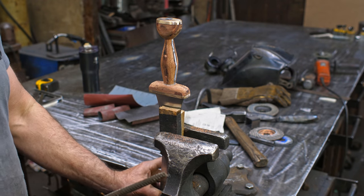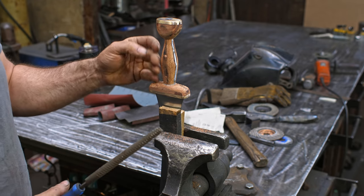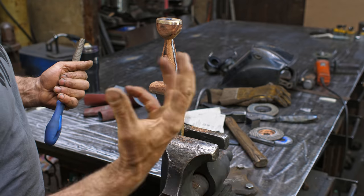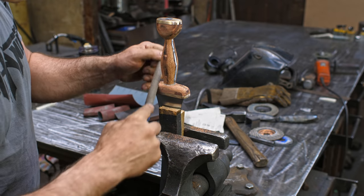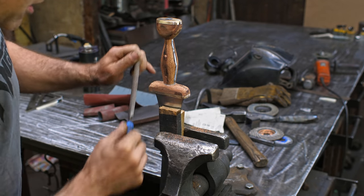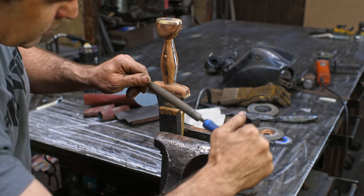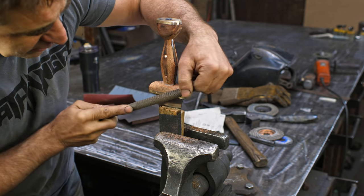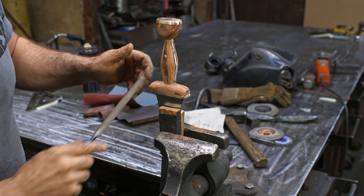It's only got a 200 grit finish on the blade. On the handle itself, I'm not going to be embellishing it in any way other than what it is. I'll be staining the wood, but I'm going to leave the wood fairly rough. I also like that as a nice positive grip. Like my hammer handles, I like to have a little bit of standing grain there to be able to grip into. I don't want it to be too smooth, because that would get slippery when you've got blood or sweat on your hand. So that's where I'm going with the look of this sword, and so far, I'm quite pleased with the effect. I'll do a little bit more finishing work here, then I'll put some stain on the wood and we'll call it a day.